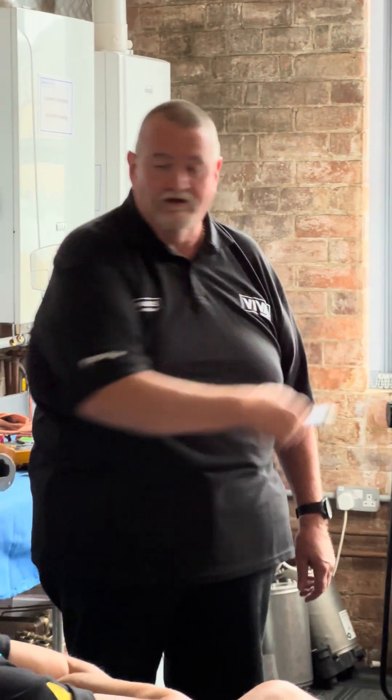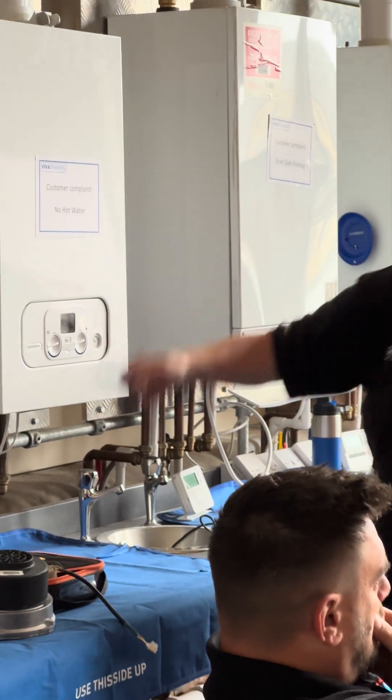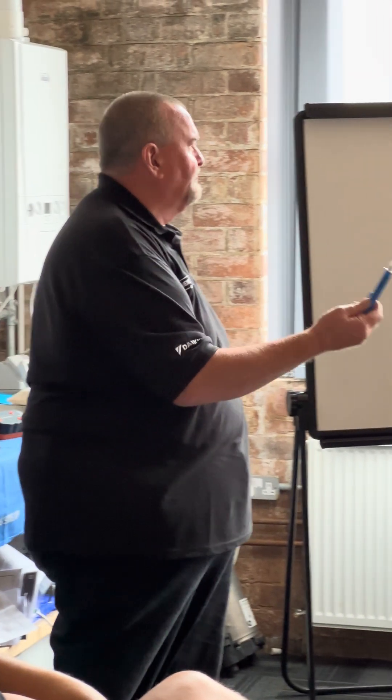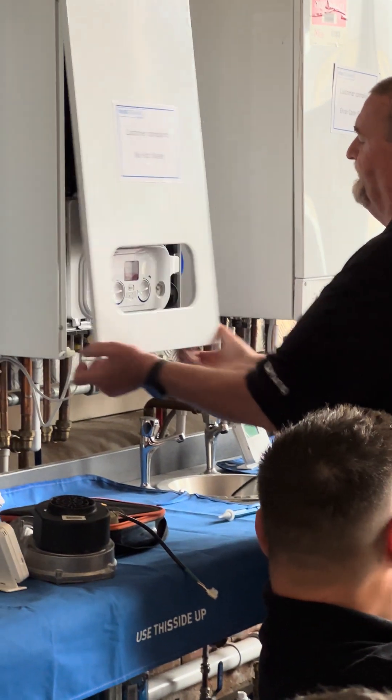Before I used it I just tested it on that TV to confirm it works. Generally we'd pop it onto a fused spur, see that it's operating, then use it across the case and pipework to confirm that's safe. These devices are also useful beyond TB118 safe-to-touch — they're also good when you come to fault finding.